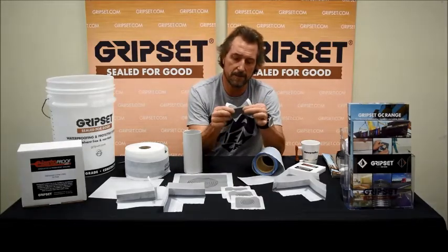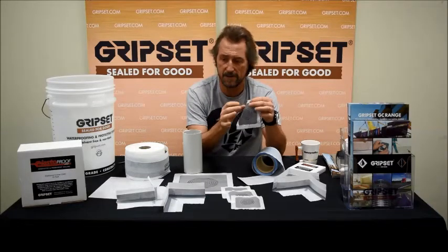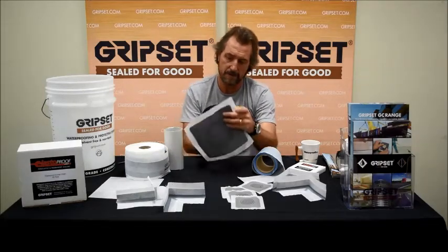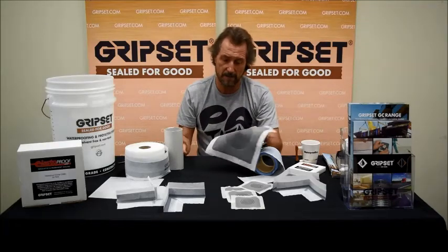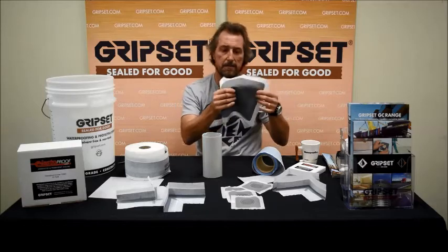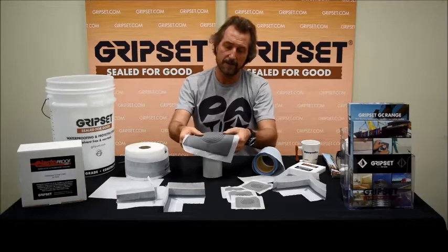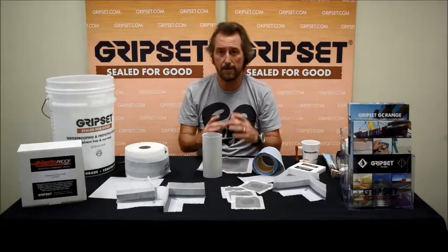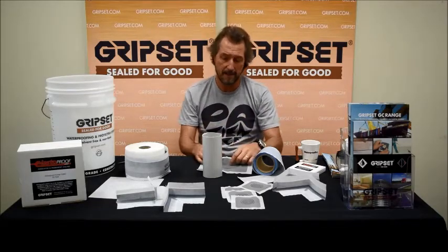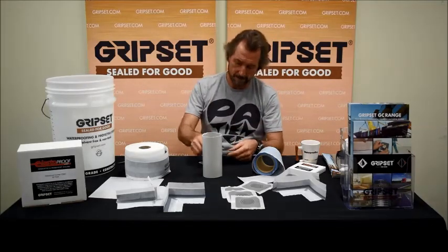So we developed the elastic collars. They have a target diagram on them, and there's a free zone that we can cut and slide over pipes. We have these in various sizes — small, medium, and larger ones for larger pipes. For a standard 78mm pipe we'd use the medium size collar. I work out the hole using the target: I don't cut the full diameter of the pipe in the rubber — I go about 60 to 70 percent of the diameter because it'll stretch over.